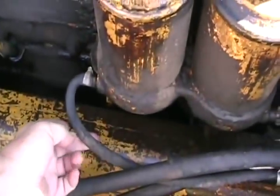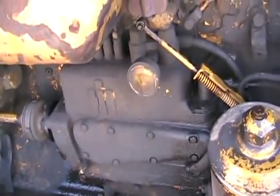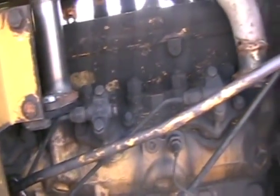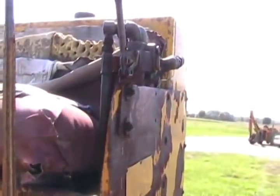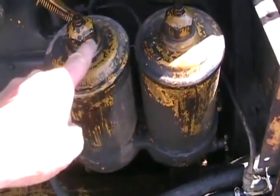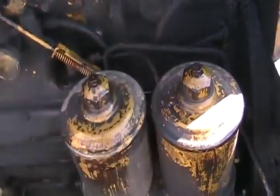The fuel tank was out of diesel last time I started it, and like any diesel machine when you run it out of diesel, you've got to bleed and prime the system. Now it's all topped up. Fuel line comes from the fuel tank, goes to cartridge-style filter number one, goes to the second filter, then comes out and goes to that big old injector pump, which puts high pressure to the injectors. To bleed it, I loosened and removed these two little screws on top. Gravity pressure pushes the fuel through — this one bleeds first, then this one bleeds second — and as soon as you see no bubbles, you tighten them up.